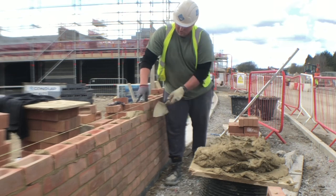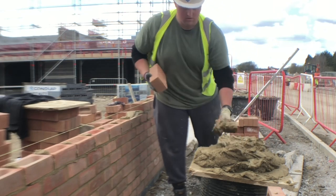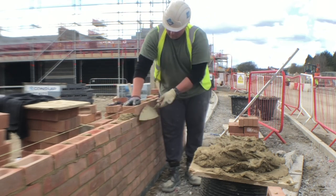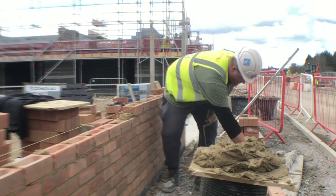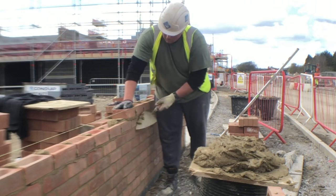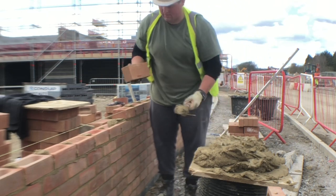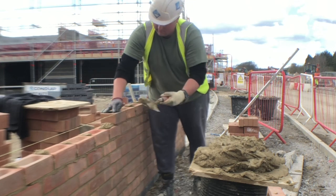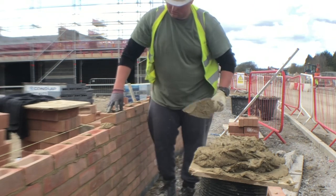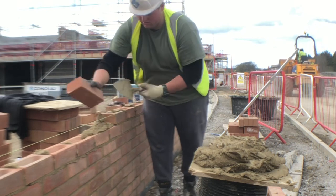I definitely recommend racking the pillars back — it just takes away one plumb point every time you reduce the pillar. If you imagine taking a pillar and flattening it all out, like a two-skin return or a dogleg, it's like you're building a big corner on a house. You've just got to imagine it like that, but obviously you turn the corner, so there are extra plumb points in it.